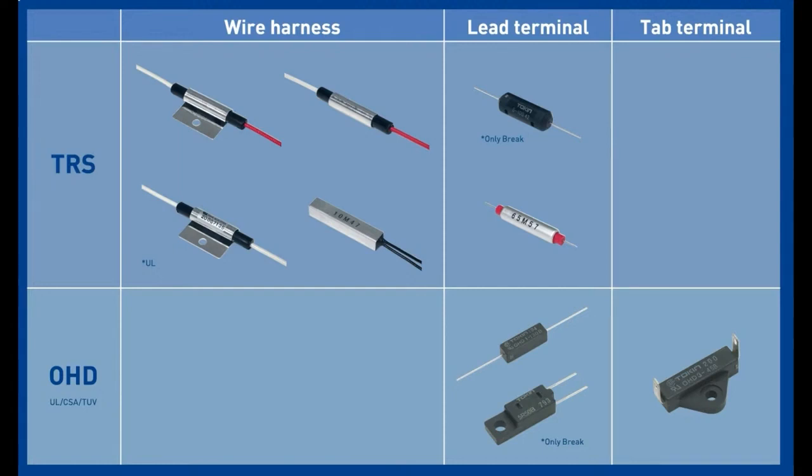Physics seems to have not let us down yet. You can rely on this knowing there's not going to be any funky watchdog timer that has to go off, or worrying about whether the PTC thermistor has some leakage current. If this opens a reed switch, it's open — there's no electricity passing through.